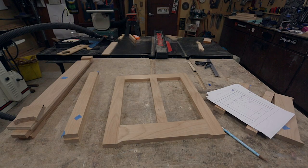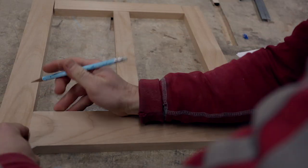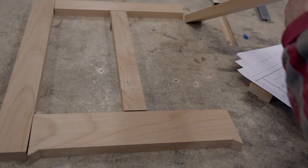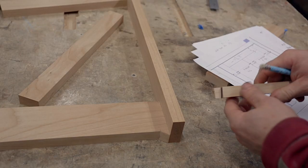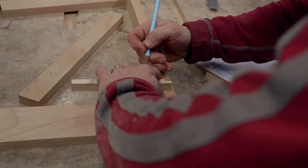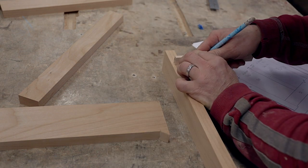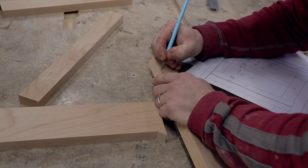I then start to lay out individual doors and drawer faces. Grain orientation is important so I take time to orient the pieces the way I want, then mark where the pieces will line up so I can do my cuts for the grooves. The grooves will extend a quarter inch deeper than the location of the board, so I use a marker to add a quarter inch down. Once I do one, I just transfer the marks to all the other pieces so I don't have to do a lot of measuring.